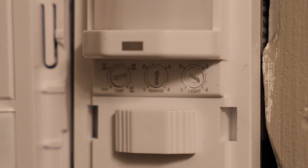But if it's a tiny room, like the one I'm in here which is just a small bathroom, it could be all the way down to 30% if you wanted to. What I think this is really getting at is, say if this was in a hallway where there's a lot of ongoing motion on a regular basis and you don't necessarily want that motion to trigger this light to come on, that's when you would want to turn it all the way to the left. But if you want literally any motion of any kind to trigger this thing, turn it all the way to the right, whether it's near or far. I want this thing to be highly sensitive, so I'm going to turn mine all the way to the right.